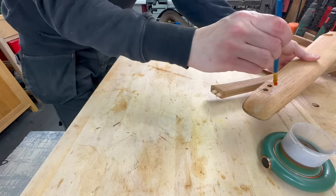Because there were so many pieces to glue together and it was a bit of a pain, I didn't record it - I just wanted to focus on getting it right, so you'll see what it looked like when finished. After sanding all the pieces, I cleaned them with mineral spirit and got them ready for staining. I decided to stain because the sides and stretchers were different colors, and there were so many repairs, epoxy bits, and wood patches that I wanted it all to be a uniform color.